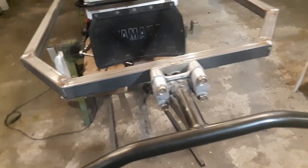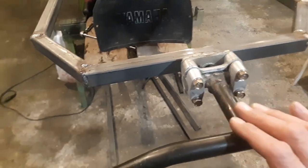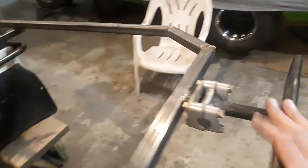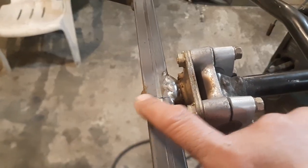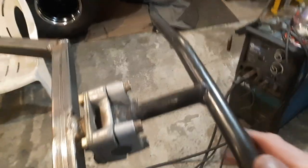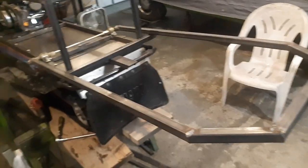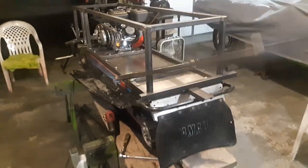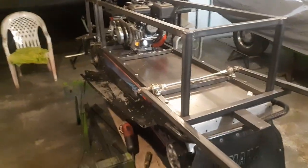What I did is I took the handlebars off the Yamaha and then I went to work on the whole column. I cut a one-inch hole through here and I welded this on there, and now the handle is adjustable — you can go up and down. I made the deal here at an angle so I can fold it all the way over, and then it's easy for storage.